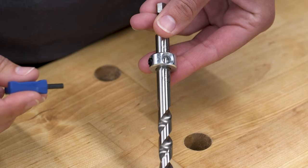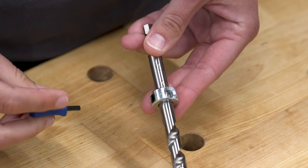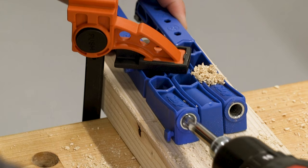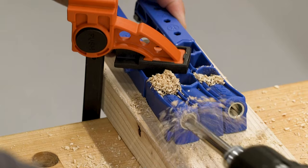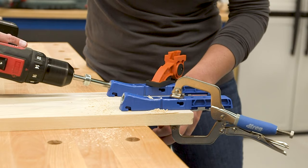After that, all you need to do to finish setting up the Kreg Pocket Hole Jig 320 is to position the stop collar on the special easy-set step drill bit. It has engraved measurements that match up with the thickness gauge and the stops on the jig. Slide on a simple stop collar until you see the right measurement through the window, and then lock it down. Now you can drill to exactly the right depth every time — no guessing, no worry about getting it wrong. Just drill until the stop collar contacts the jig's drill guide, and you'll have a perfect pocket hole.